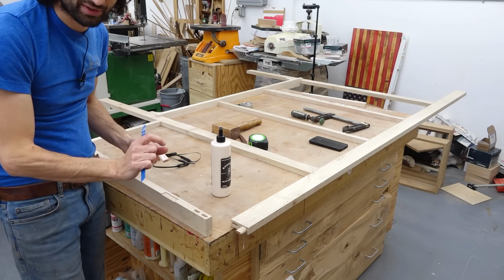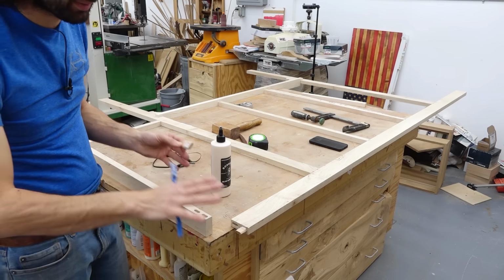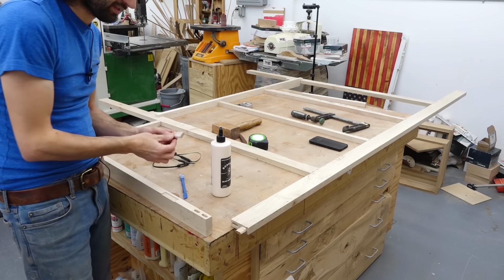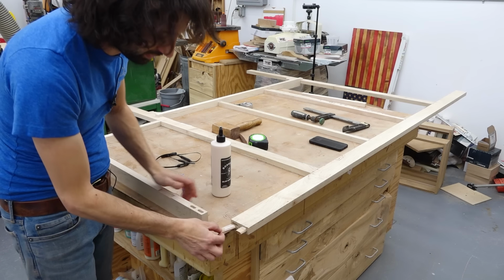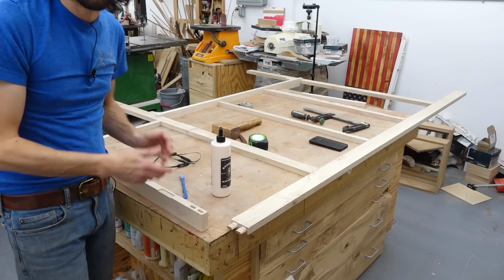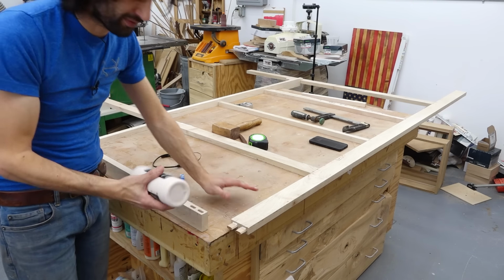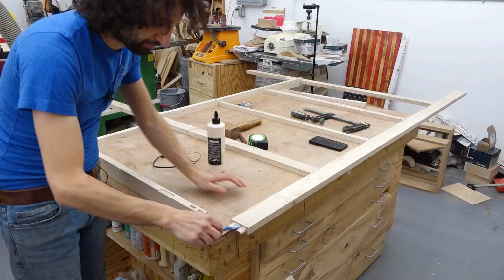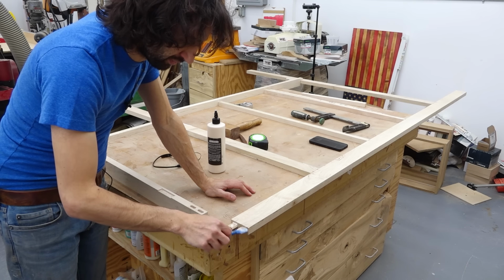So it's only a 1/4 inch thick, so you don't have that much material to actually remove to fair your curves or make your shape or whatever. That's going to make actually making your shape a lot easier. And the fact that it is, well, in my case, MDF, that's a much easier material to sand and finesse than solid wood or even plywood or something like that. So those are your bigger advantages.